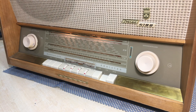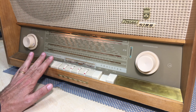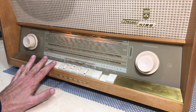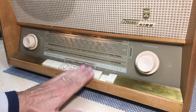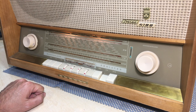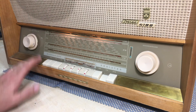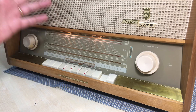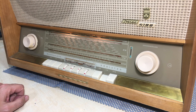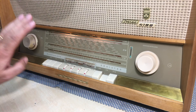That was the demo and here is my conclusion. Longwave — this thing is magical. It actually picks up on longwave, which you can't say the same for the long wire or the ferrite antenna. You get very, very little on ferrite, even less on long wire, and with the MiniWhip it is magical. I'm probably the only guy in Madeira that actually picks up Radio 4 from the UK. It's quite amazing. So, low frequencies, longwave — it is fantastic.